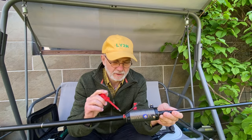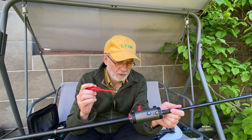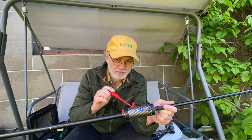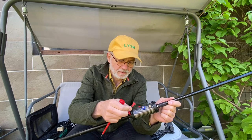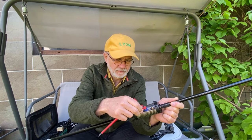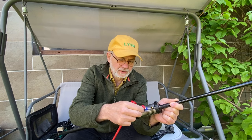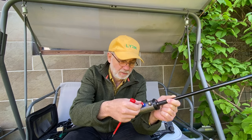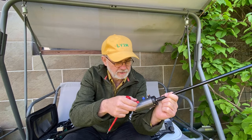When it comes to the coils, overall it's pretty good quality. Good plastic, firm and sturdy, good quality wire. What is problematic for me personally are these nice, candy-looking pick-off clips, as they call them. You connect the lower section of the antenna with the coil by this smallish banana patch cord, which goes into a pick-off clip connector. I'm not sure it sits sturdily. Sometimes I think it's too loose, and I'm not sure about the quality of the contact it makes. Well, it makes contact, but I'd like it to sit more firmly in this connector.